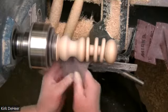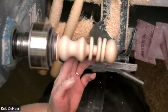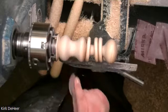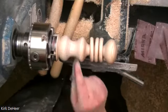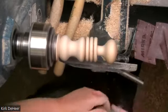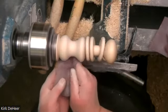Oh yeah, that feels much better. We'll finish running through those grits right here in those spots that we just touched — everything else looks pretty good. As a note, you can make a rattle out of any wood. I haven't had any issues with anything. Cedar is particularly difficult because it's so soft. We don't turn pine because life is too short to turn pine if you don't have to. But everything else — I've had a good time. I like making them out of walnut, and my favorite is to make them out of peach, apricot — any fruit wood makes gorgeous rattles.